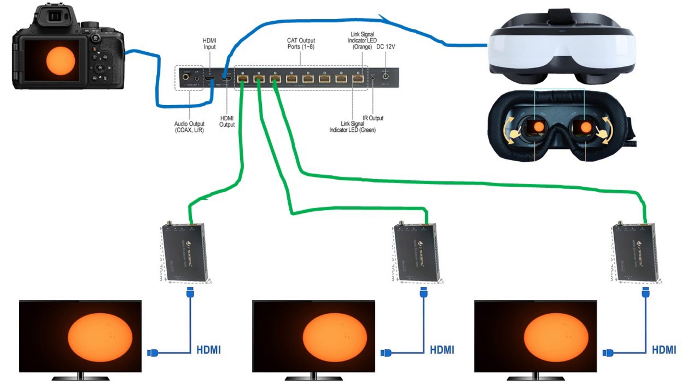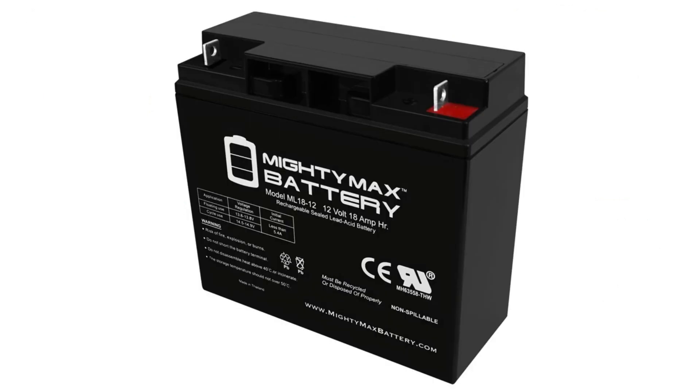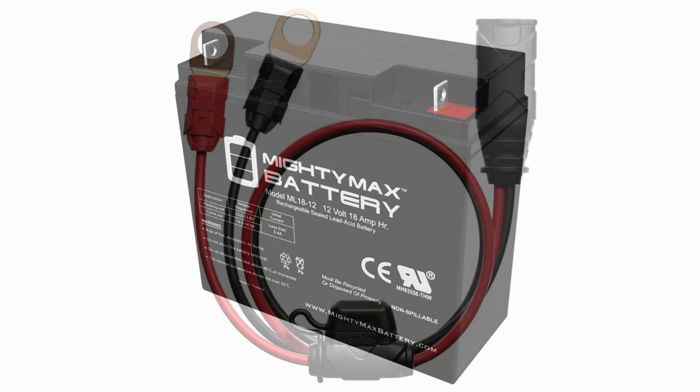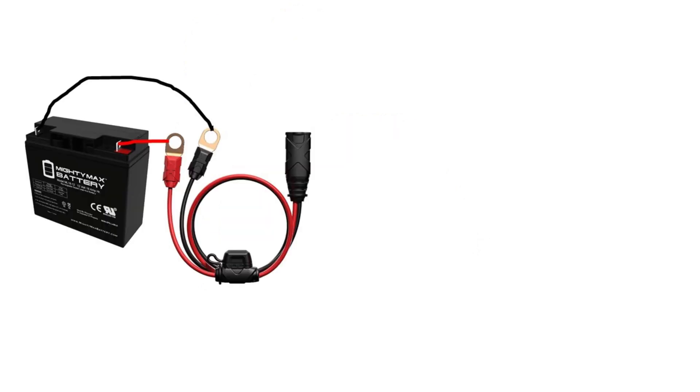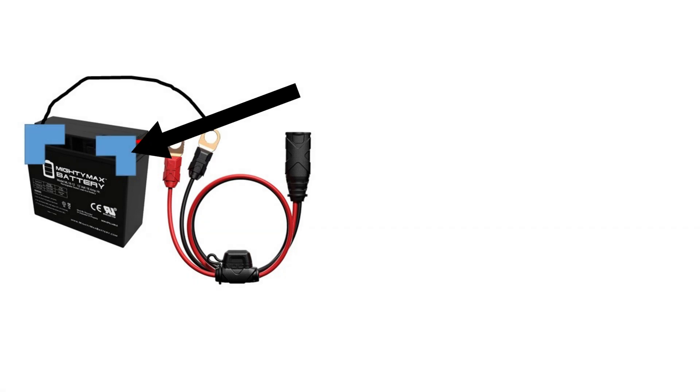Now that we've looked at how to wire all the devices together, let's look at getting power to all the devices. Start with a 12V 18 amp-hour battery — it has the right amount of power to last a long time and isn't too heavy. Next, we need a NOCO terminal harness with a female socket on the other end. Using the screws that come with the battery, secure the harness to the battery's terminals making sure colors match. Shorting a battery's terminals accidentally can be very dangerous, especially with high-capacity batteries. I cut a piece of soft plastic and place it over the terminals, then use electrical tape to secure it. The terminal harness also has a fuse box — if connectors accidentally short, the fuse blows and opens the circuit, preventing an electrical fire.